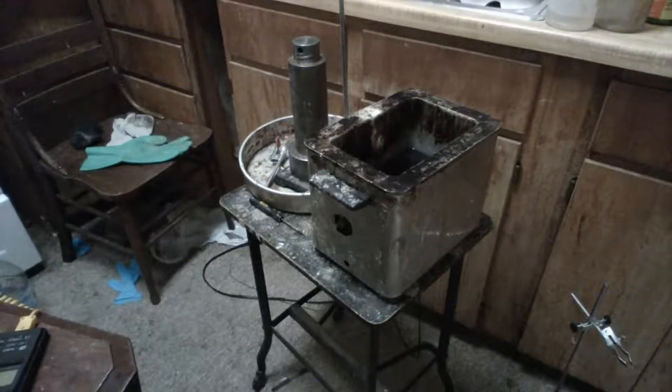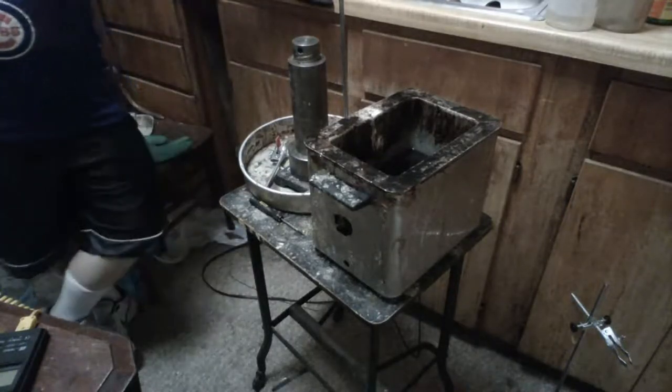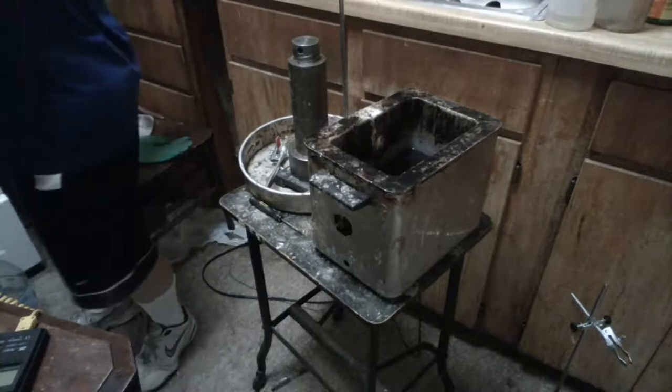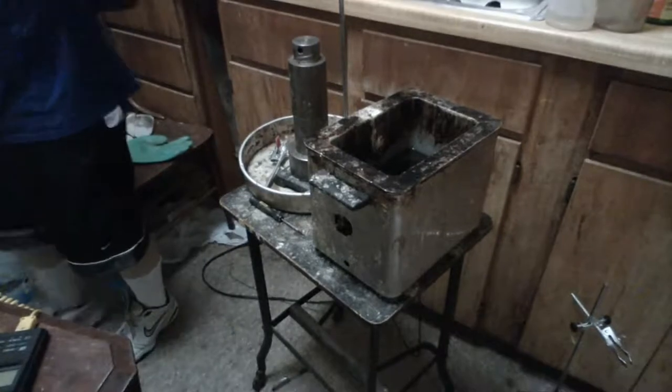But as always, you write down your molding temperature, which is 174 degrees centigrade. That was the wax temperature. The mold was at 250 degrees. If you put your mold in and start your wax, it'll even out, where your wax is up to temperature and your mold is ready. Okay. This is going to buzz and I'm going to give it 5 more minutes, which will make it 40 total minutes. Okay, so give it 5 more minutes.